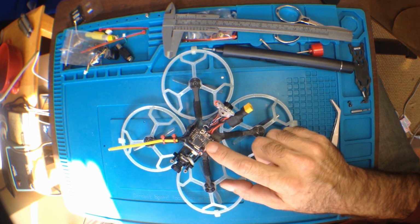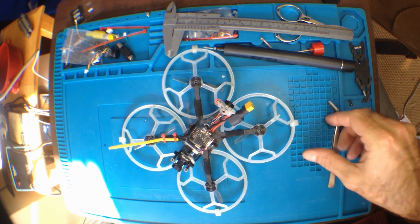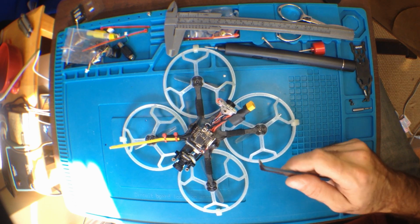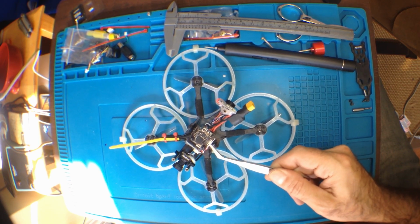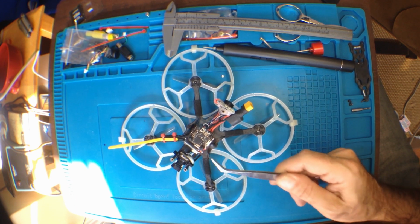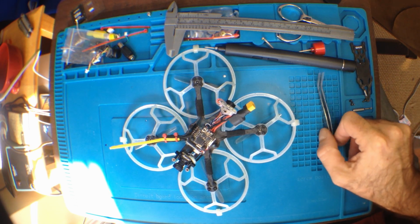On this one, I only got 3 UARTs, and I believe they're all used. So I looked up the STM32 F411, and there is only 3. I was like, oh, maybe I can tack them on some unused IO pins. But nope, there's none left. Got none left.